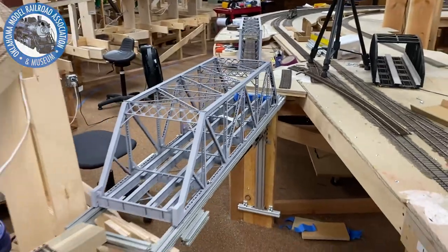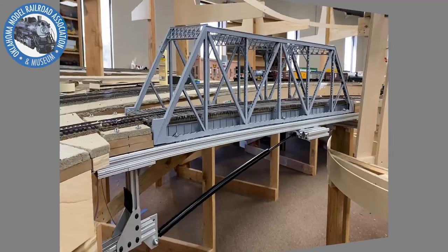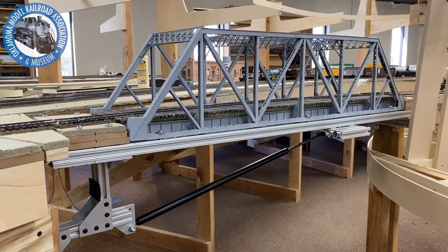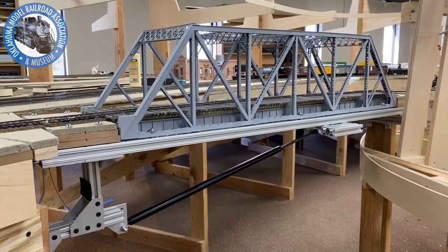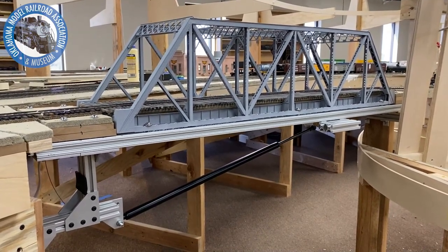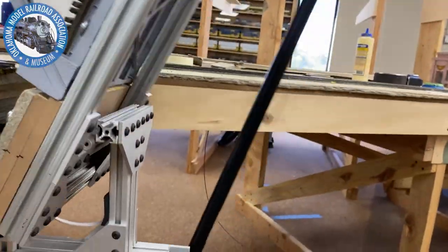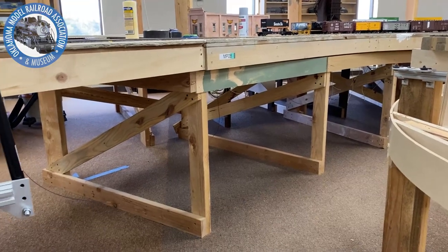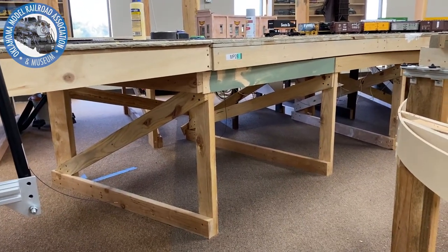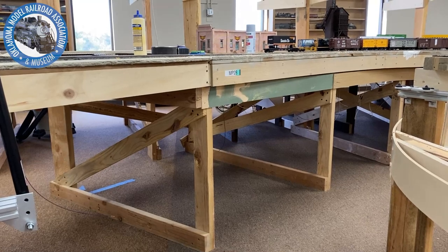there's our swing gate. And what that does, that connects that other line, and it's supposed to create a natural barrier to keep people out of this area back here. It's operational now. Just kind of show you a few things about it that we've learned in the process. The frame of the gate is 50 inches. By the time we get this gate open, with the strut location and basically the curvature of this area, we've got a 30 inch opening in here, so that's pretty good. I would assume that's probably what everybody would like to see.